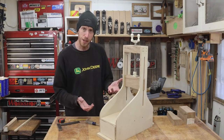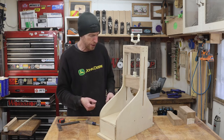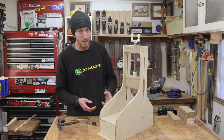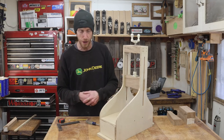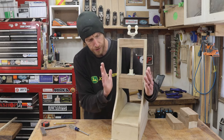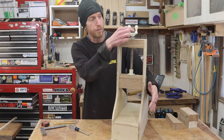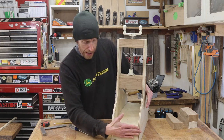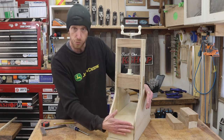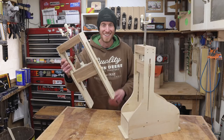Technically you could probably use this as it is — you'd have to use some clamps to bend the sides around it. I've seen really simple jigs used that way. But I want to make this a little bit easier, a little more user-friendly. The next assembly I want to work on is going to be very similar to this center clamp press. The only difference is there's going to be a couple of movable arms that, as you're bending your side, you can pull those arms down, and then there will be another clamp to clamp it tight against the mold.